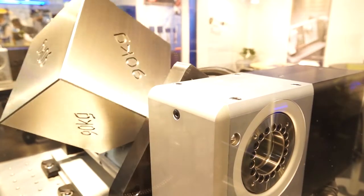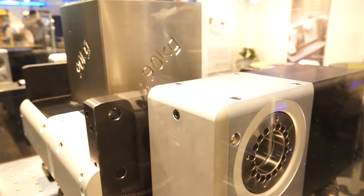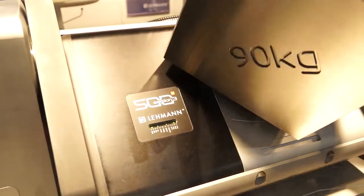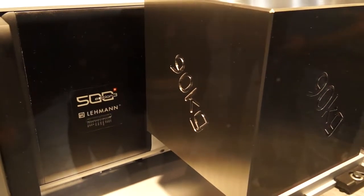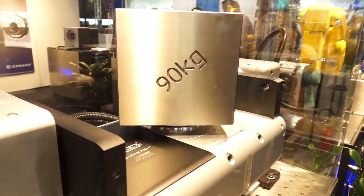There are packages available for all those machines including servo amplifiers, parameter lists, commissioning instructions — either the customer can do themselves or we have our own team that can do it for them. So as an engineer, if I've got a three-axis machining centre and I'm thinking I want to migrate up to five axis, this is an option for me to install onto my machine? Absolutely, and obviously the main benefit is that you can install it onto the machine, and if you need the machine for other work you can take it off.